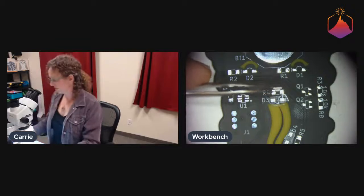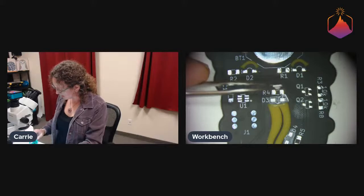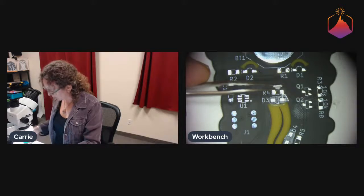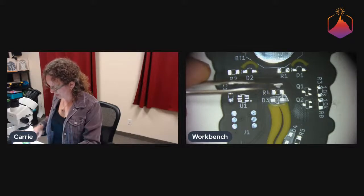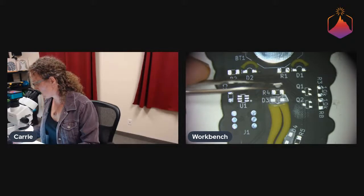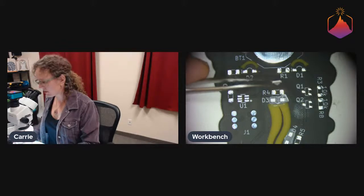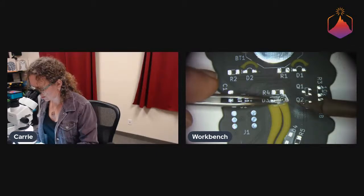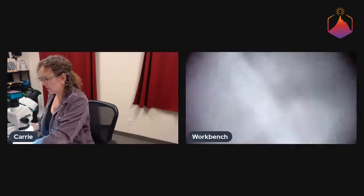And let's see, grab out my solder. My iron should be ready. So this is lead-free 0.6 millimeter, I think. Yeah, 0.6 millimeter solder. This is actually a little bit big for surface mount stuff. I prefer having skinnier solder for surface mount stuff, so maybe 0.4 or even 0.3. It's relatively big surface mount stuff that we're doing, so this would definitely be too big for 0402s, and it would kind of be a pain in the butt for 0603s.